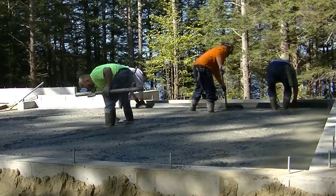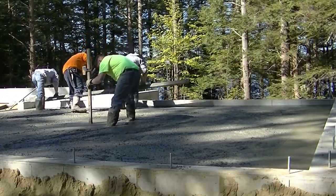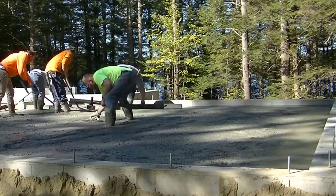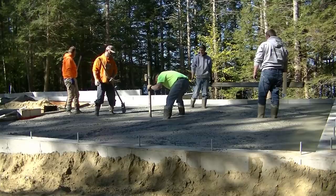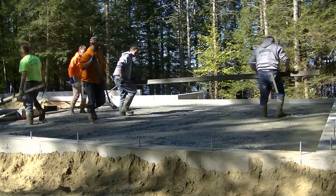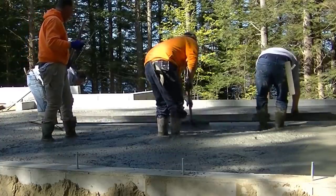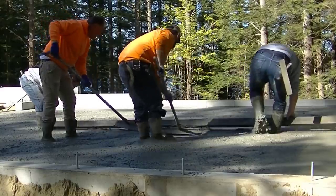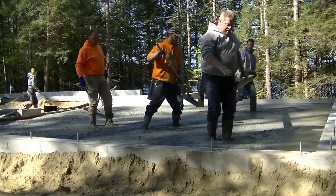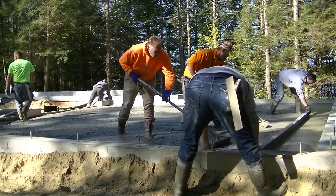Darren's shooting the center pad with a laser, and Luke and I are striking the edge over there, because the water on the surface covered our chalk line a little bit as we built it up. We just want to make sure our grade is sloped just the way it should be. This floor slopes two inches from the back towards the front, so down the road if somebody's parking a car that's dripping, the water will work its way toward the front and not puddle up under the car. We're striking our center pad — this is what we use as a wet screed reference, along with the wet pads around the outside that we mag to the chalk line.